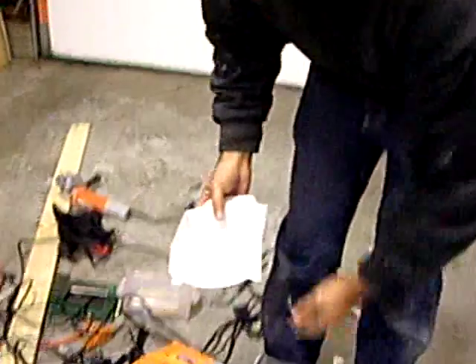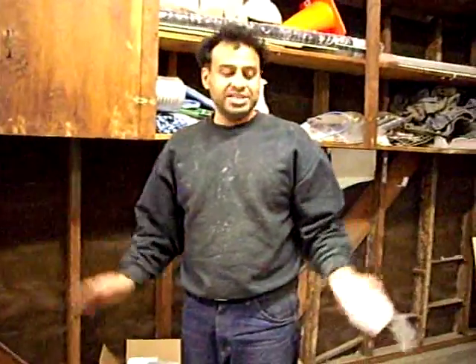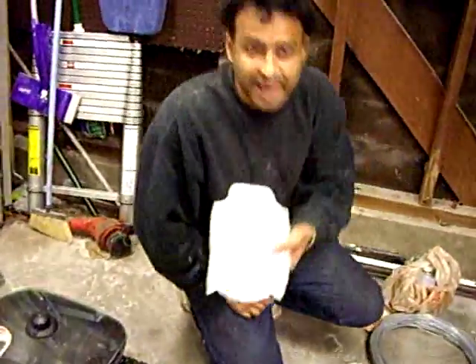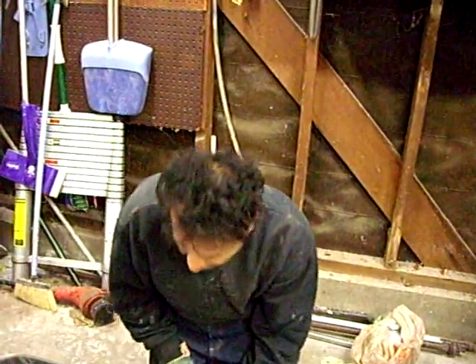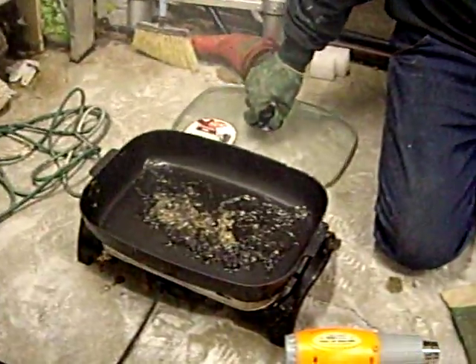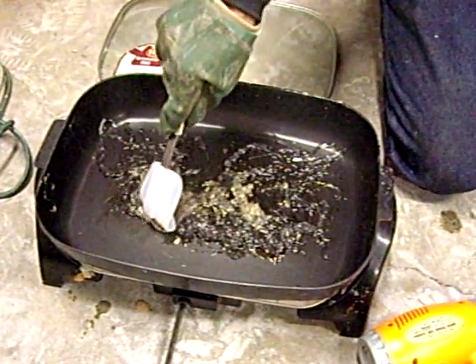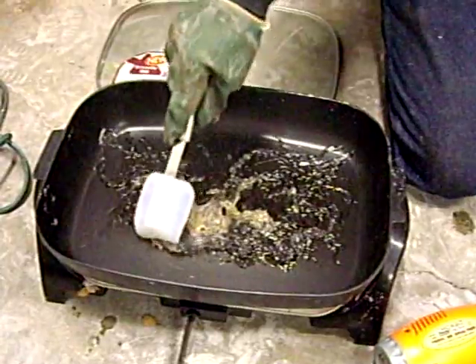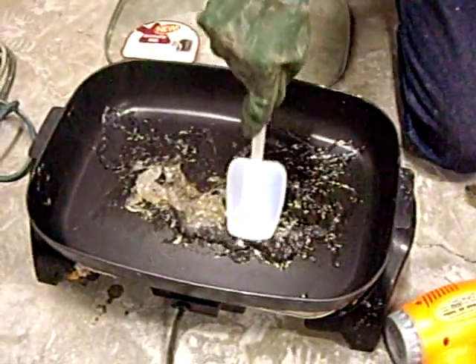But on my way of doing that, I found out that even if I had a metal mold, it wouldn't make a difference, because unlike the two-part resin mixture, low-density polyethylene — which is what I would prefer to make this dustpan out of — does not flow like a liquid and take a form very easily, unless you have extremely high pressure. What you're looking at over here is low-density polyethylene heated up way above its melting point. But the problem is, this thing does not flow, and unless you have a lot of pressure, you are not going to be able to form anything with this.